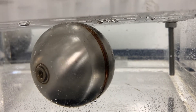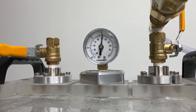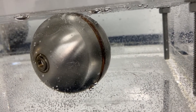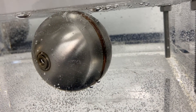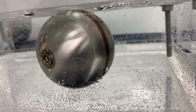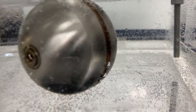So let me turn on the pump again. We're going to go to about 15, 16, 17 inches of mercury and now the bubble emission is visible right there. It's actually kind of cool — you guys can see it right there.